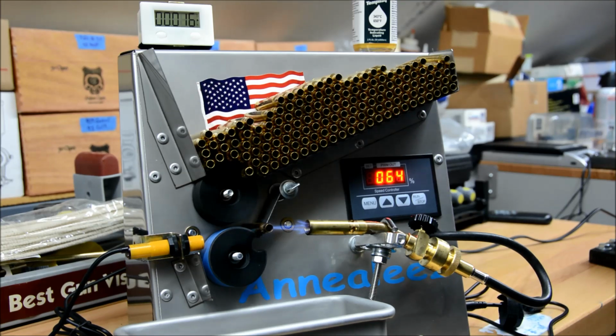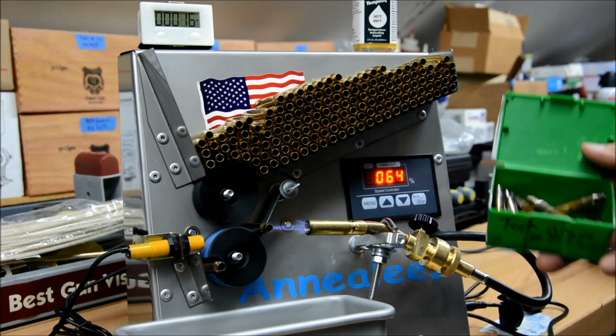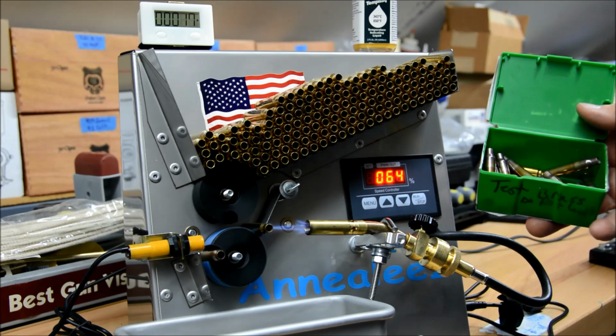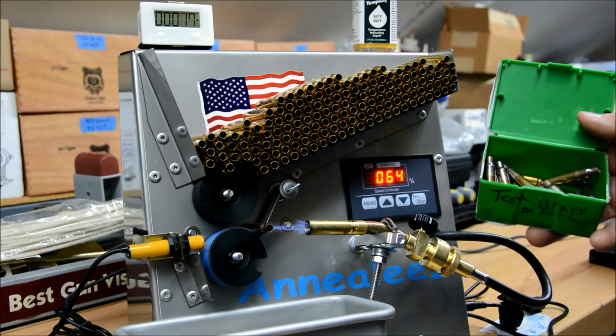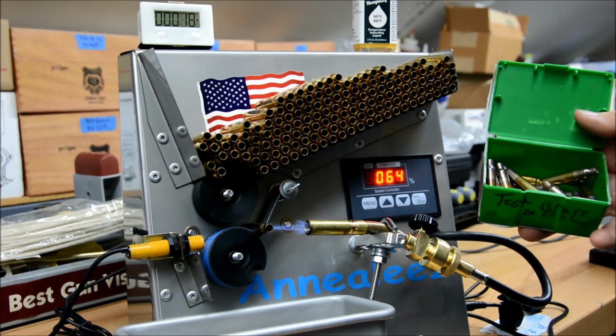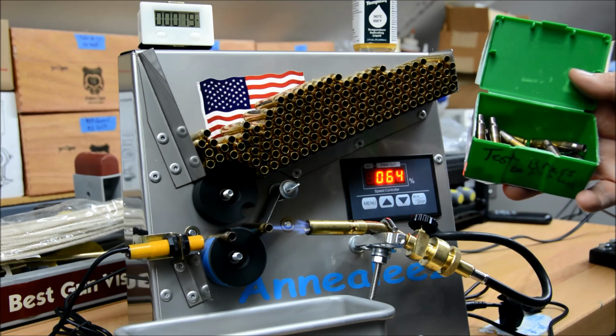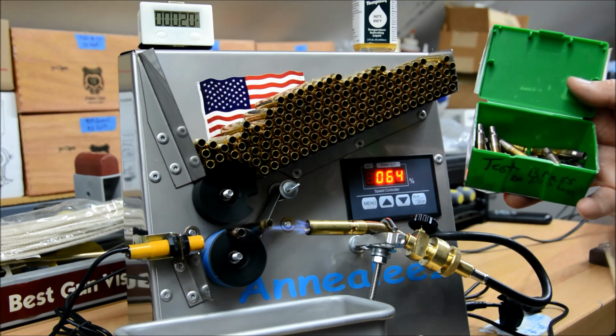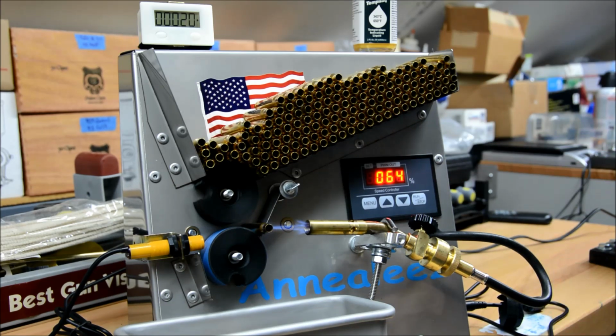I also use, like others have suggested, some of these for setup. So some cases I can reuse, put Tempilaq on, things like that, and just keep them separate because they will have been over annealed. You can also put them in the flame and check to see if you see the orange flame chart appear. Make sure that does not happen. And you'll see here that is not the case.